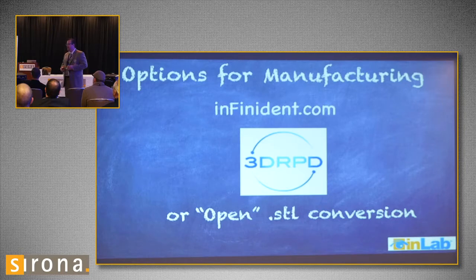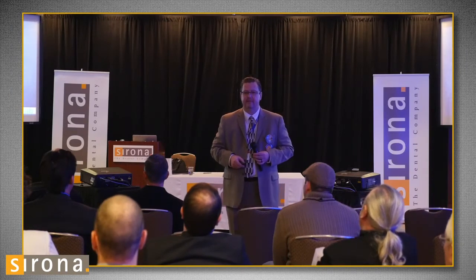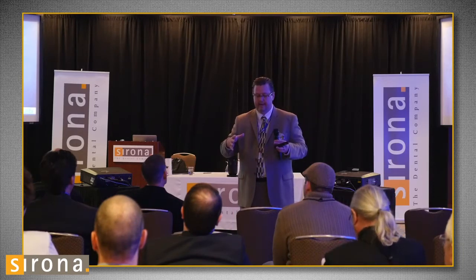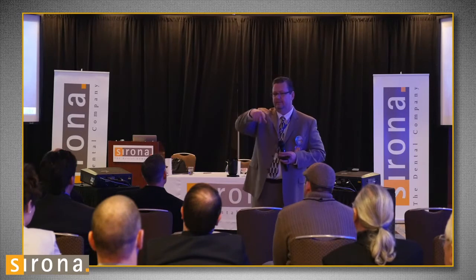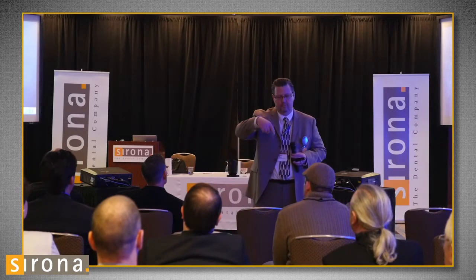So our manufacturing options, and these are the ones that we've been using, are Infinident and 3D RPD. These guys are here. Highly recommend you go by and see them. Fantastic system. Really impressive. SLM printing of metal. So we're not milling this out. We're not waxing it and casting it. It's direct printing of metal. They start with a platter, if you will, put 20 microns of metal on it, press it down, and a laser welds the first layer together. Another 20 microns of metal, welds it together.